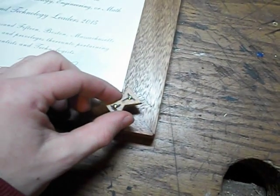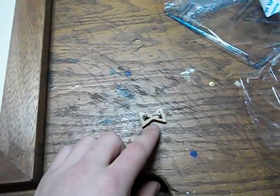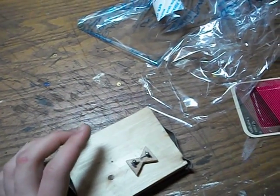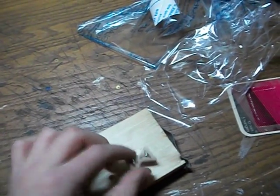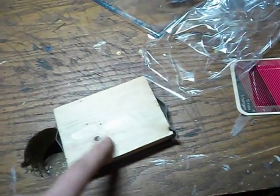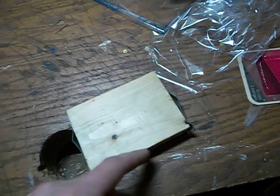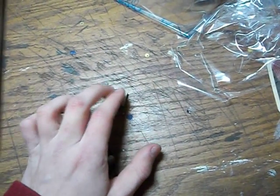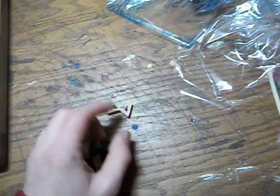I still have the template for these small ones. What I did was I made a small piece — this key is the same size as this key, as you can see. I used this to mark out the actual wood I'd be cutting. So if I'm cutting it out of this material, I put the key down here, tap these nails down, then I can trace around it without it moving, pop it back up, and cut this out — whether you're using a bandsaw, handsaw, whatever. That is the template I use: mark in about the centers, put in these little nails, tap those down, and it's not going to move. Mark around it with a knife, cut those out.